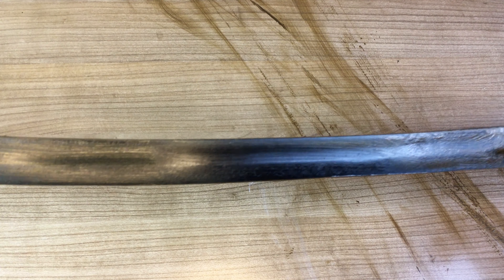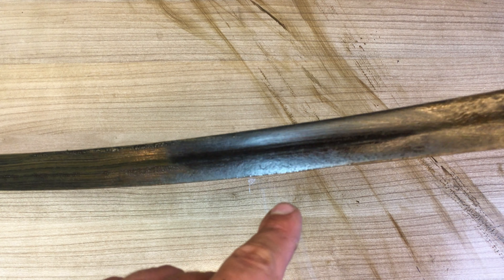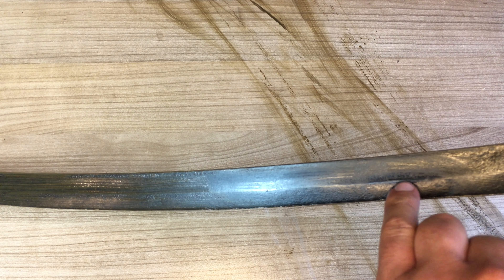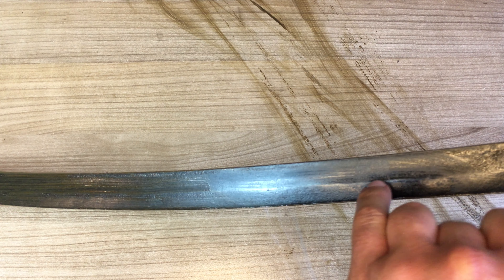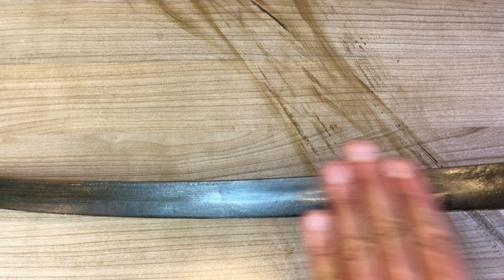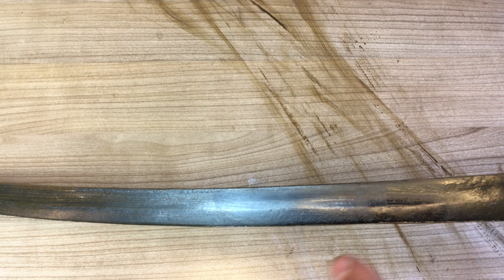With a bunch of cleaning done, I wiped away a little bit of the muck and dirt, and I think I'm going to stop here. The reason is that you can see — where there's a very shallow fuller — it's starting to remove the patination. You're starting to see a little trace of a line where the fuller is, and I don't want to do that. Removing material like that means material is coming off. So we're stopping here, wiping off the autosol and dirt, and getting an idea of what further work may be needed.